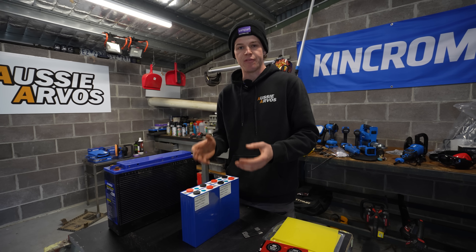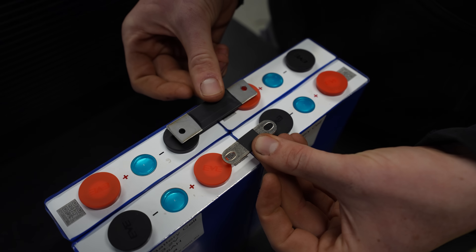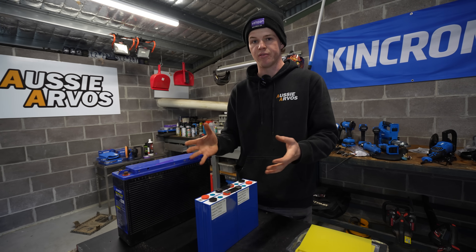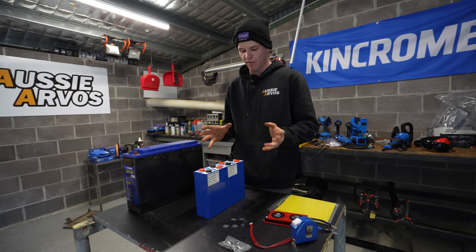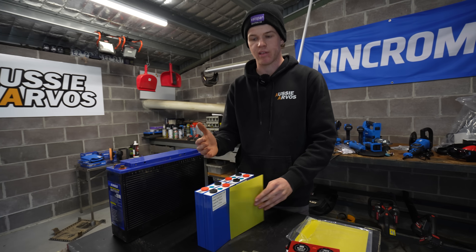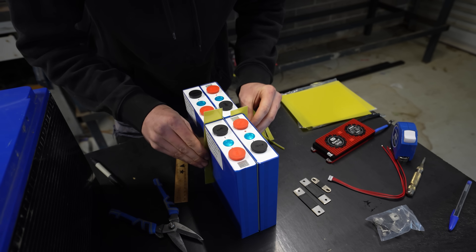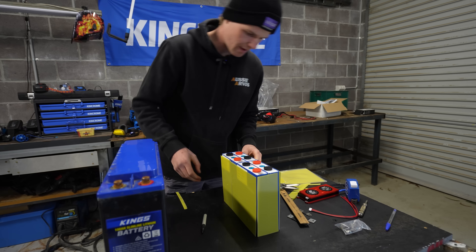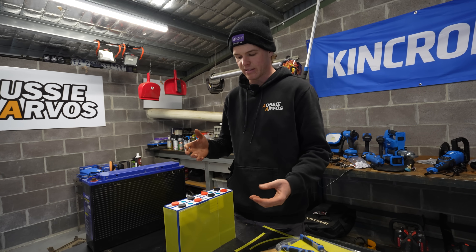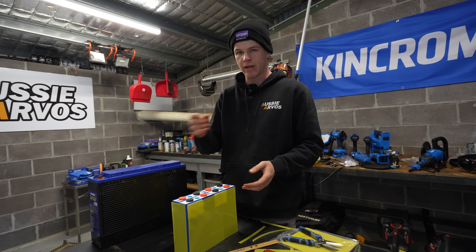To get the battery to work in the particular configuration I wanted, I've had to create some of my own bus bars just to join the terminals. The ones that came with it are only long enough to orient the battery side by side, so I've made some longer ones which will bridge the gap and it'll all fit together nicely. Now that I know the bus bars are sorted, the next thing is to figure out what insulation sheets I need to cut in order to separate everything correctly. With the insulation done around each cell and all faces protected, next I'm going to place the bus bars on and make sure all the cells are sitting where they need to be before we secure them together.